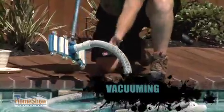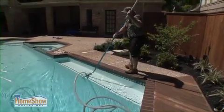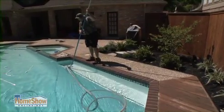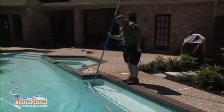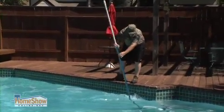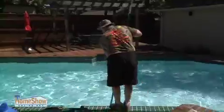Some people want to know how to vacuum their pool. So what we'll do is we'll start up high. I'm vacuuming this ledge — I'm going kind of slow. You want to make sure you really get everything. If you go too fast, you can stir it up. You really want to try to go all the way down. I'm actually pulling this way, and what it's doing is pushing the brush against the wall, all the way down.